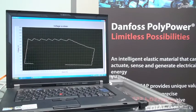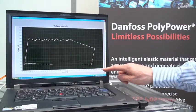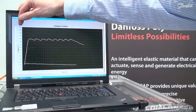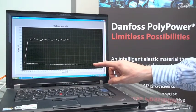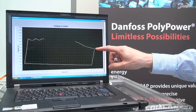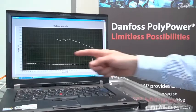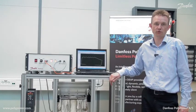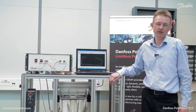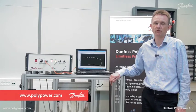On the computer screen you can see how we are actually converting the mechanical energy to electrical energy. On the x-axis we have the strain of the material while on the y-axis we have the voltage. You will see that we have strained the material at a relatively low voltage. We are then charging it, then relaxing again, and up here you will see how we are actually harvesting the excess energy and then repeating the cycle. No doubt that the technology has a bright future within renewable energies and energy harvesting, on applications such as wave energy plants, green road bumps, buoys and many others. For more information please visit us on www.polypower.com.